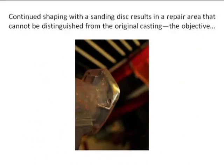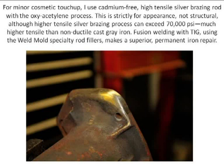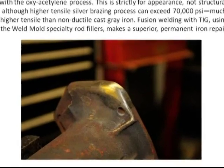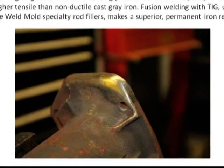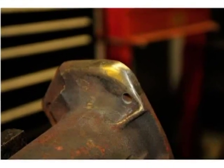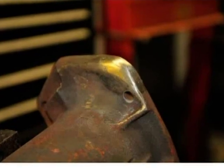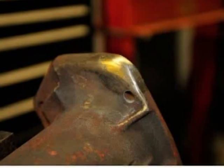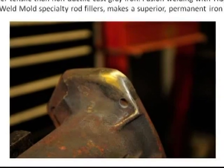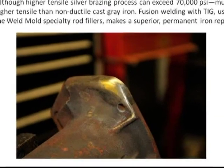This is something I'll mention if you want to do small touch-up repair — this is high-temperature silver brazing rod, not silver solder. You can get tensiles up to 70,000 and higher. So if you want to do cosmetic touch-up work on a casting, you can use this process. This is brazing at a much lower temperature than fusion welding — typically 1,100 to 1,700 degrees depending on the material — which is less dangerous when you're working with casts. For touch-up or cosmetic work, this is a great option. You want to avoid silver brazing rod that has cadmium — make sure it's cadmium-free. It'll be a life-extending service to yourself.